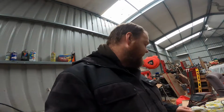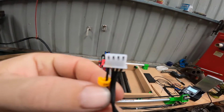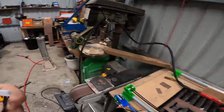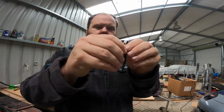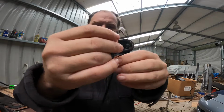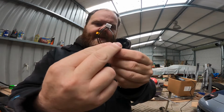Can I suggest, if you haven't done it before, or you're not amazing at it, when you do it, get your cord like this. Let me just put you down so I can. There you go. Okay. When you get your cord like this, pull the wires apart, because they're all joined together in a ribbon. Pull them apart. Cut that one there.